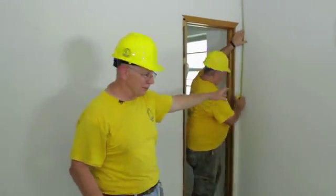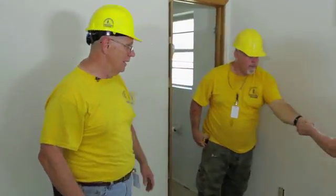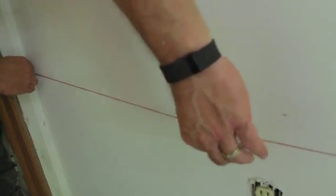All right, now we're going to do the exterior wall. We're going to measure down 6 feet on the exterior wall, starting on the exterior, so we know exactly how far the water has wicked up the insulation on the outside of the walls. And then, once we have measured down the 6 foot for a 2 foot mark, we're going to snap a chalk line so we can cut it out.